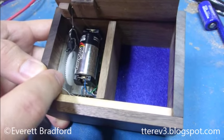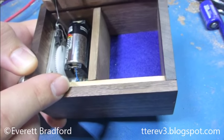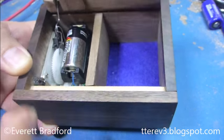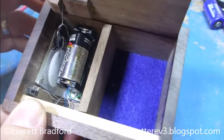That generates a little voltage spike which is kept in check with some resistors, and that wakes up the microcontroller — you can see it down there — by throwing a pin high. It then wakes up and runs the motor until it sees the limit switch. There are also basic checks for timeouts in case something goes wrong with the mechanism.